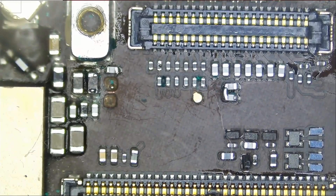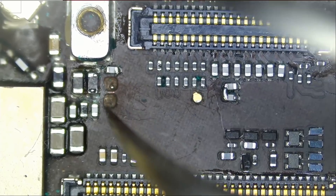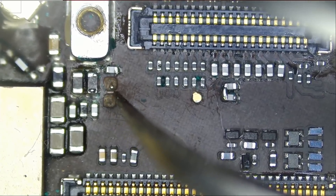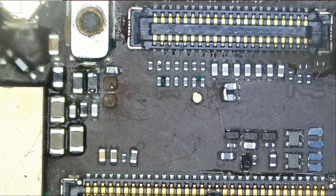The tablet is not showing anything on the screen because of a missing backlight filter. The question is how are we going to solder a backlight filter here if we have two missing pads. We cannot solder the missing component here anymore, and we haven't exposed the ground layer here. The first thing we need to do is look at the board diagram to see where each trace is going.